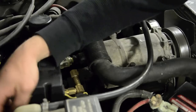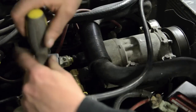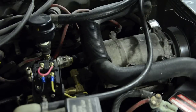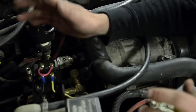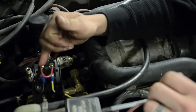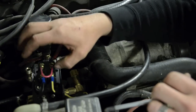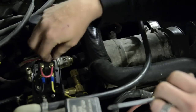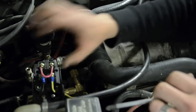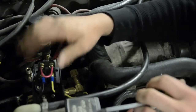Don't worry about fusing it at that spot. Just run your wire up and run it into this. Just to give you an idea of what it looks like inside, I'll open it up. It's a really simple way of wiring things up, and you can pick this up at your local industrial parts dealers. The way these work is normally you have a motor running off of this circuit, so I've just bridged that over to complete a circuit. When it reaches 160 PSI it pushes up on the springs and turns it off. Once it drops back down to 120, it turns back on and completes the circuit.